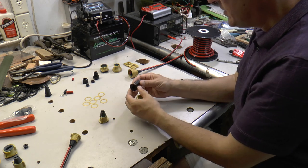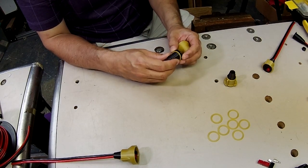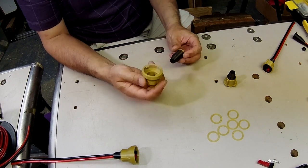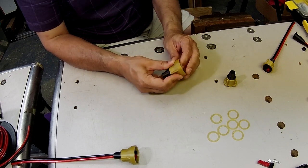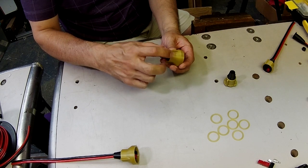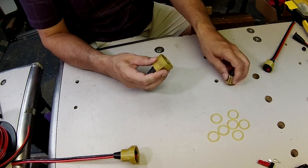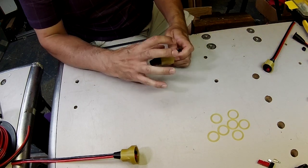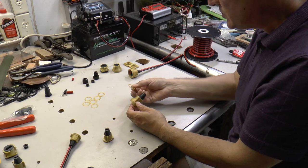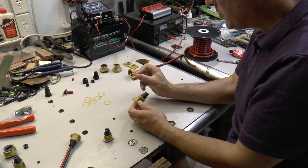And on this side, it has a little friction washer that goes between the lip of the boot and the inside of the housing. And that's there because when I first made these, the interface between this housing was pressing on the rubber lip of the boot, and when you put these together and got them under compression, there was too much friction and they would get stuck. To reduce that friction, I designed in a little friction washer that's 3D printed.